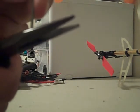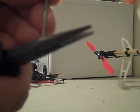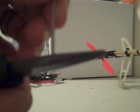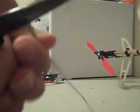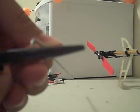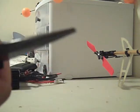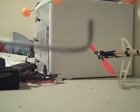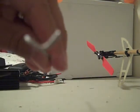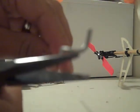The difference for a snake bend is that when the rod is set up straight, you're going to put that first bend in the flat part of the jaws of the needle nose. Then you're going to do a 90-degree bend that is in a side direction — so bend it again that way. This is what you end up with. It's kind of ugly, but the idea is that you have what they're calling a snake bend. Looking at the rod going away from you, you have a pretty good flat surface right here.